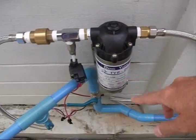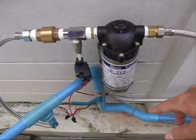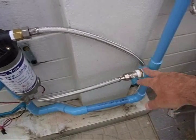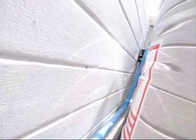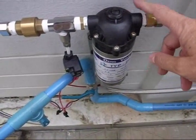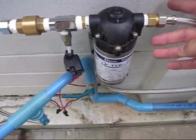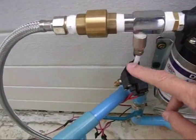There's not much to it. It's a 24 volt pump, 2 liters a minute, which is a very minuscule amount. It's hooked over here from the intake of the city intake. We have a sand filter back in there. It runs down here, comes through the pump — it's just a diaphragm pump. Its typical working pressure is about 80 psi. It's capable of 130 psi, which is a lot, and that's one of the reasons I have this pressure cutoff switch on here.